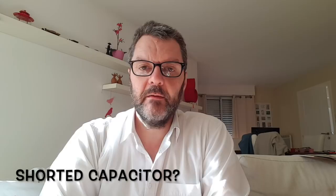So I think I'm going to have to stick with using a 49-to-1 transformer in a plastic box like I've been doing. Of course, it's going to work better with sending Morse code using CW or using digital modes. Voice modes, as you just saw, is a little more difficult, but I still managed to contact England on 5 watts. So have a good one.